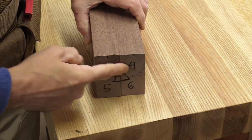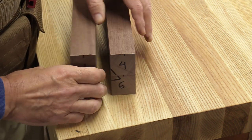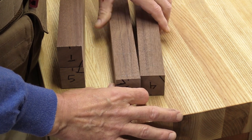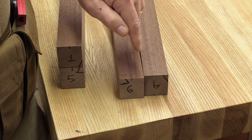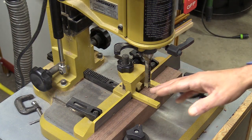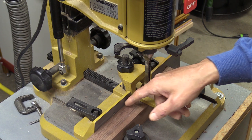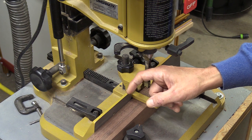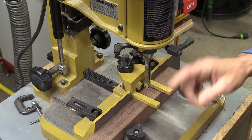I've got the four outside legs and I've marked a carpenter's triangle where they go, marked 1, 4, 5, and 6. Before anybody asks what happened to 2 and 3 — those are the two legs that go in the front of the cabinet. I've marked out all the joinery, all the mortises, and all the grooves for the panels. I just need to go to the mortising machine and start getting all the material out of the mortises. I do need to be really careful because there are differences in how far some mortises are from the fence, and this piece is an inch and 5/8 tall by an inch and a half wide.